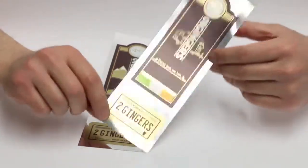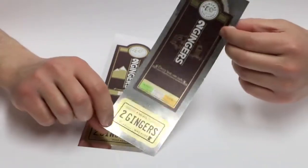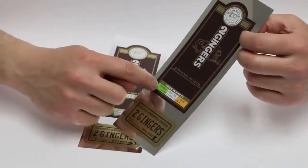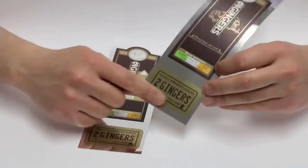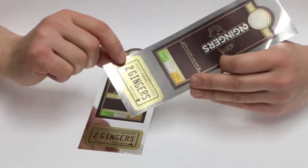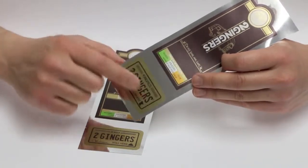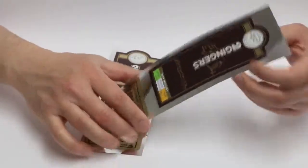What we did in this case is take a bright silver chrome finish label stock and print white ink in the areas that need to show true color, like the green, orange, and brown here. We printed a yellow shade directly on the silver without white backing, so in the yellow area it becomes a gold look — as you can see in the light here — so that area becomes a gold foil.